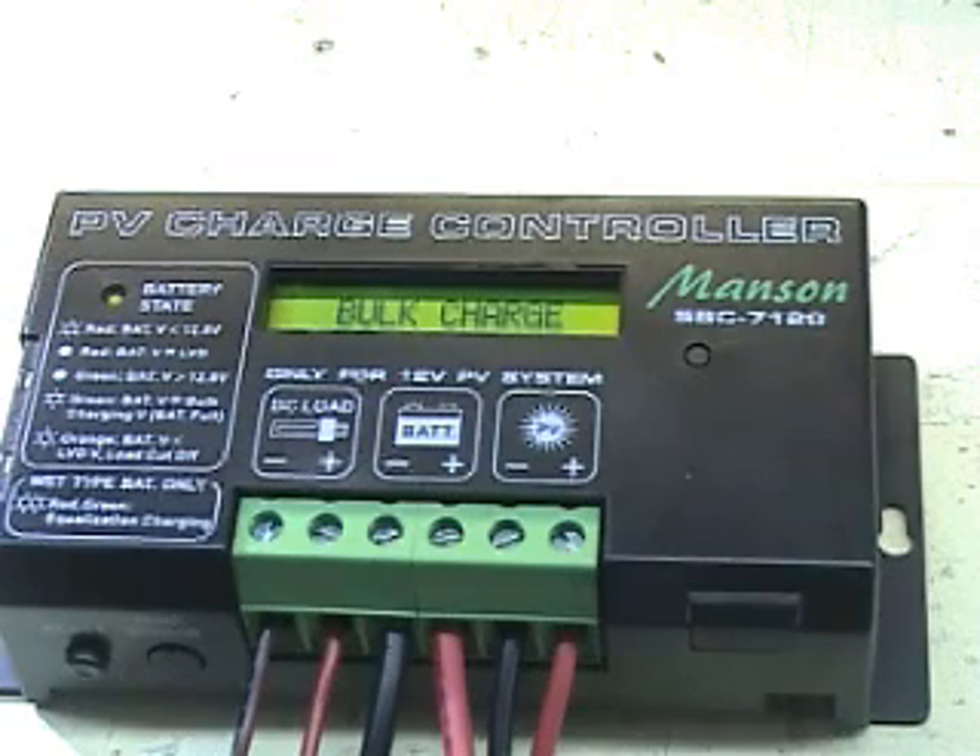Make sure you don't have any reverse polarity. You should use red as the positive terminal and black as the negative terminal. Make sure your wire thickness is adequate for operation, and all wiring is fully inserted so you can tighten it without any bare wires visible.